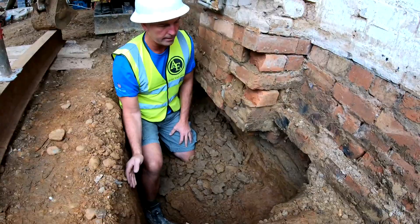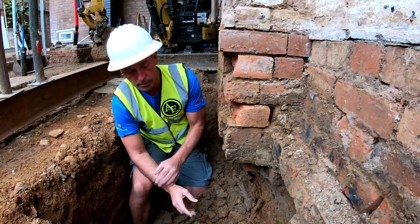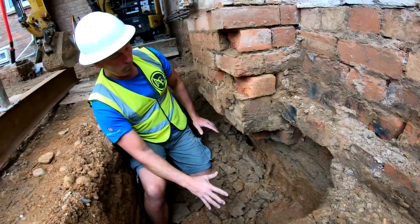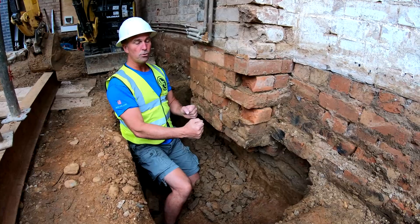You need to make sure you've got firm ground. We've got sandy gravel here and it's absolutely great ground once we get to a meter deep from this ground level. What we'll do is flood this with concrete, put some shuttering up all around here, bring it up to this height, then vibrate the concrete. That gets all the air bubbles out and stops any movement through shrinkage, then that allows us to crack on with the build.